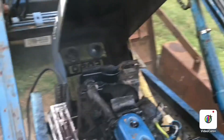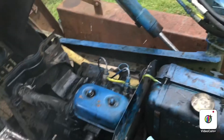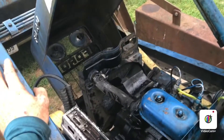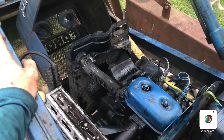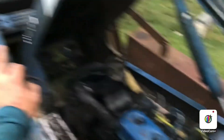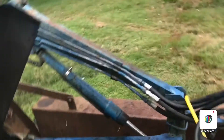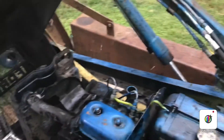I don't want to do too much running of it until I get the cooling system drained and make sure it's got good 50-50 coolant in it made for diesel. As you can see right now, I had the truck on there because I was going through batteries. Now I can switch it off to truck power, but that truck gave it the good cranking amps that it needed to really get that thing turning, to get whatever was flowing through there that wasn't flowing through there.